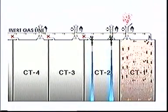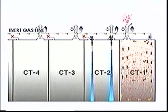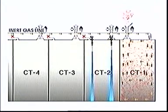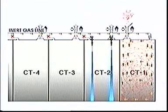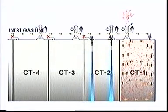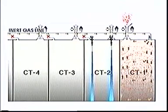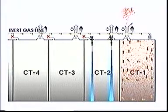As a matter of discussion, it is also possible to purge tanks through the bottom lines in this ship. This is a matter of company policy. It is our experience that this method cuts costs when already gas-free tanks are inerted again. When doing this, you should try to inert half the number of the vessel's tanks at the same time. In our vessel, purging the tanks should be done over deck after the cleaning. Other ships may be designed for different methods of purging and inerting.